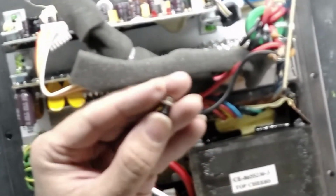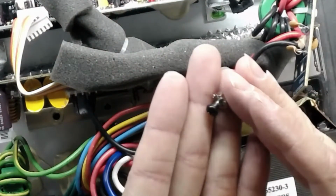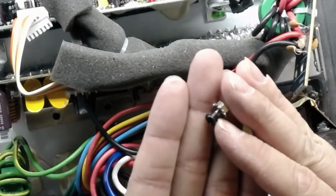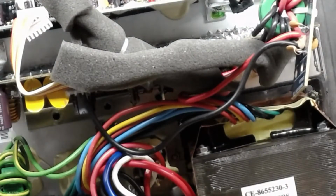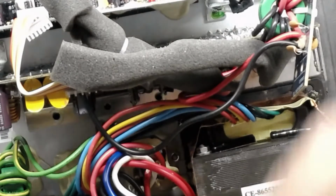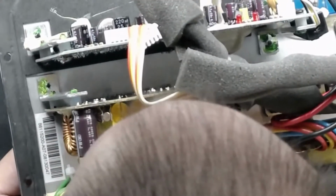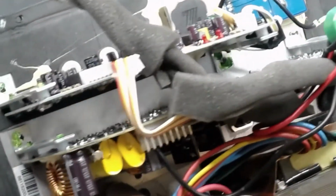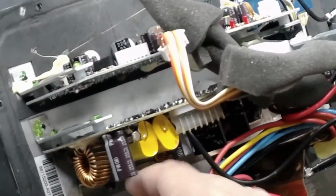This screw must have been loose from the factory, and it must have been rattling in there. You can see there's like a shiny spot right in there. There's no threads there. The threads are gone. So, looks like another factory defect. There's no reason why those threads should be gone. No logical reason, anyways. The only explanation for that is a loose screw. And luckily it's below where the threads engage, so we're not going to have any problems.